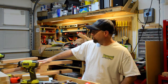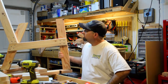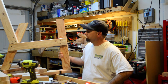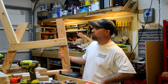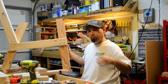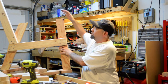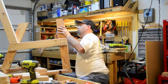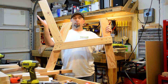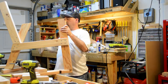During the week I got the new leg braces and back and everything done for the new bench. This one should be a lot more comfortable. I pushed it back 3.5 inches because when I sat in the other one my legs were hanging off too far. I pushed the arms up an inch to make it comfortable for my arm to be on. And before, this back was at a 5 degree angle — now it's at 12.5.